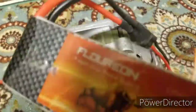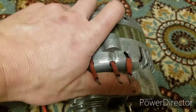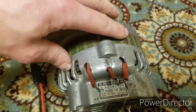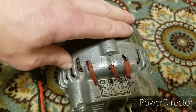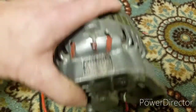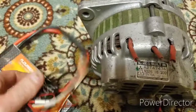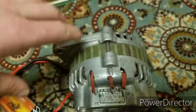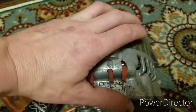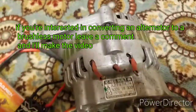I am using an 11.1 volt battery. Recommended power for this is 12 volts and higher — I would recommend using a scooter 36 volt speed control, or a higher voltage speed control from a scooter or an electric bike or something. I just did the 11.1 and the Mamba for testing purposes and to show you guys that it can be done. I will simplify it because this is really easy to do, and then you guys can start making them yourselves.